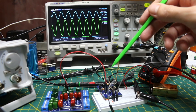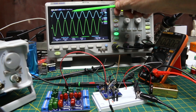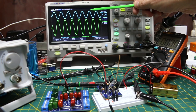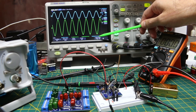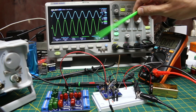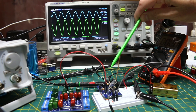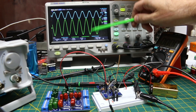I'm looking at a guitar boost circuit here and this one uses an NPN common emitter transistor circuit. To get started I have a sine wave on the top trace. It's one kilohertz and 38.5 millivolts RMS, and the bottom trace shows the output of this transistor circuit at around 833 millivolts RMS.